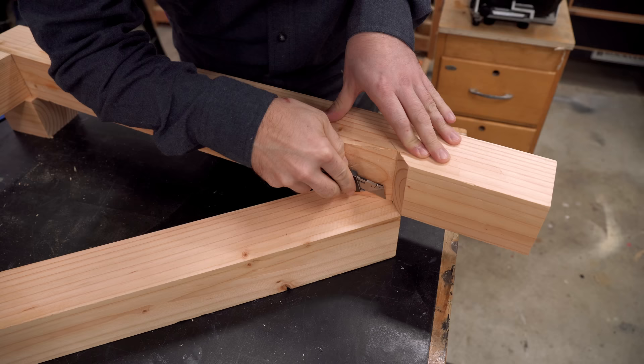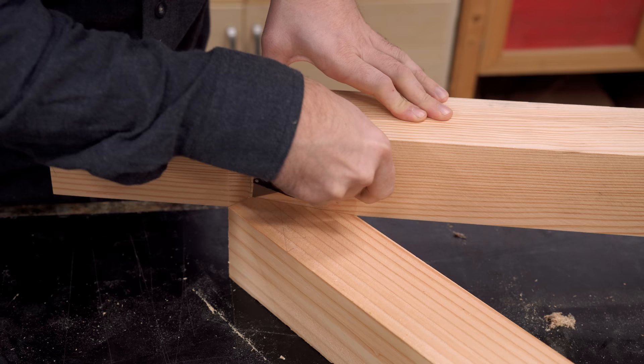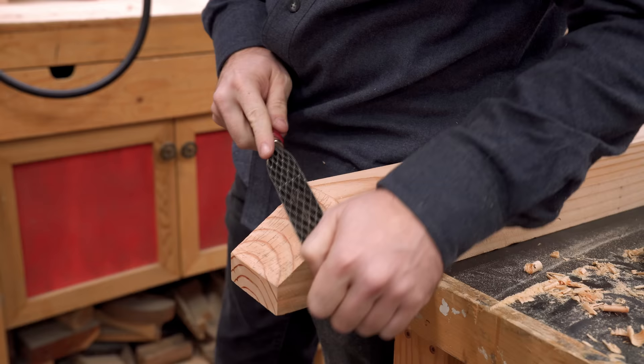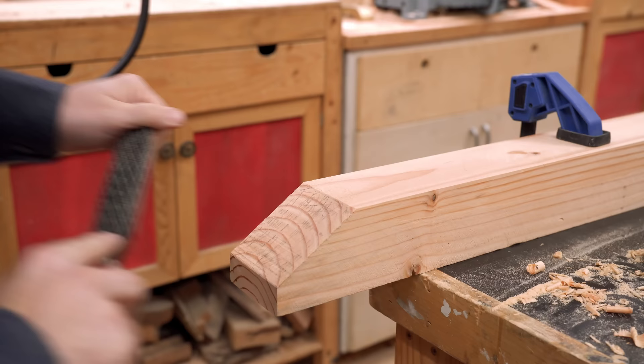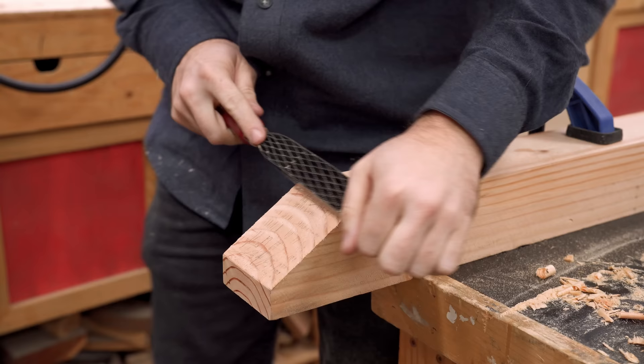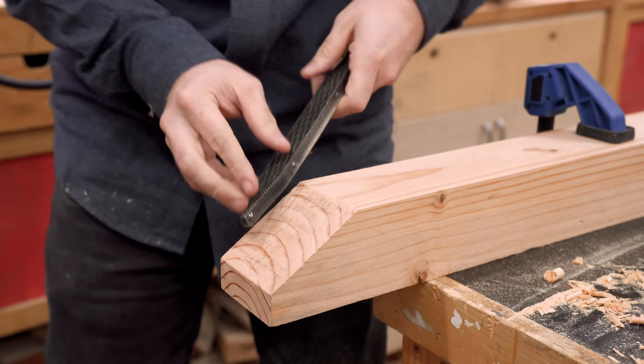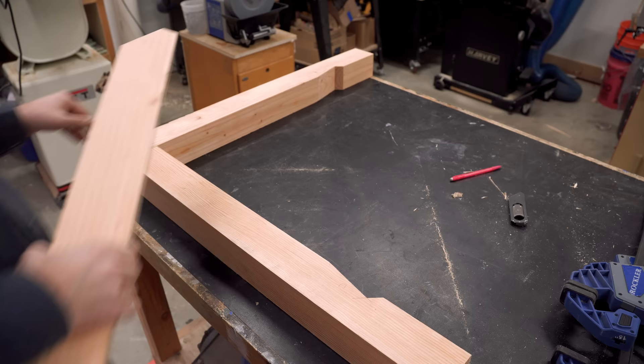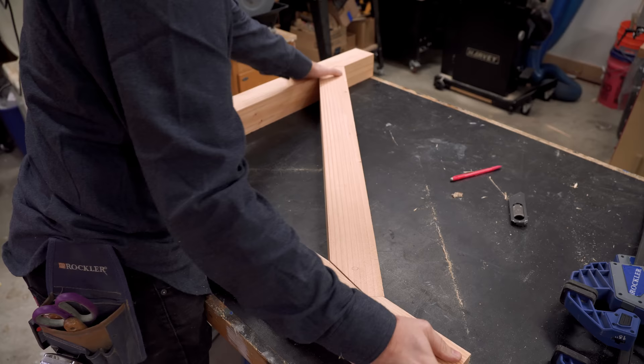With all four notches cut out I can start trimming up the braces - I'm going to be using a knife to cut in the edges. The only difference is I did decide to use the bandsaw on this one. I still decided to do some of the cleanup with a hand tool though - this is a Shinto rasp. I drew on the ends with some pencil just to make sure that I was rasping it away smoothly and I could see where the low spots were. I gave it a double check with the square and it was ready to go.